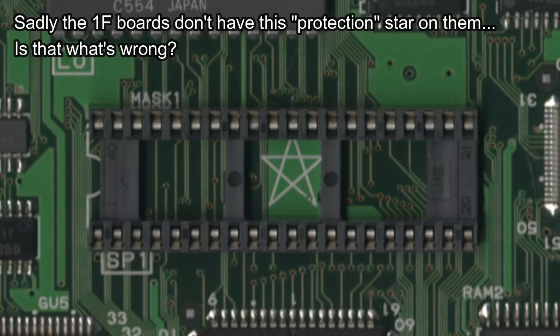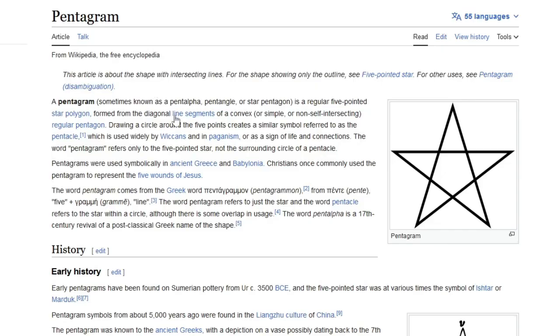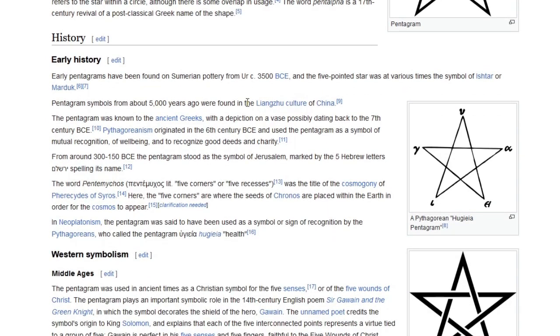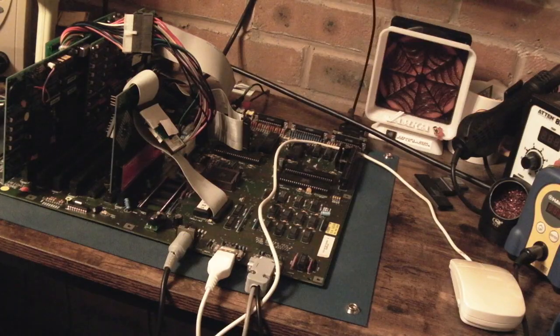So I had to bring part one to an end. There's going to be part two and a part three, I think, actually. Will we get this board working? Will I even survive editing to get to part two and part three? I honestly don't know. There were a number of mistakes in this video, as you saw. I left them in. So things like the work RAM and the VRAM addressed at the same time, I was looking at the chip select, not the output enable. But that same technique actually comes back in the next part, I think.